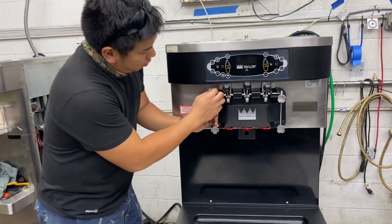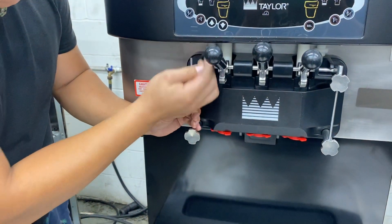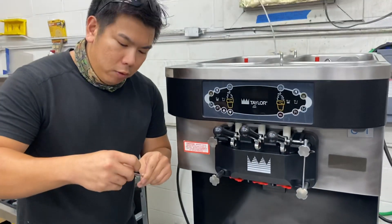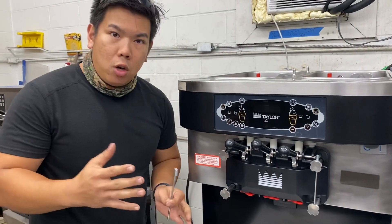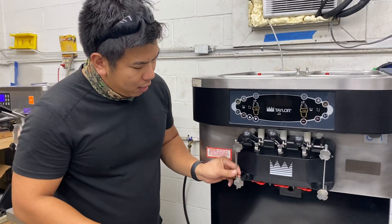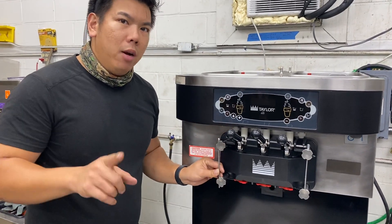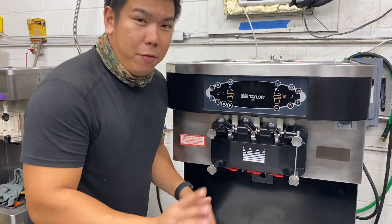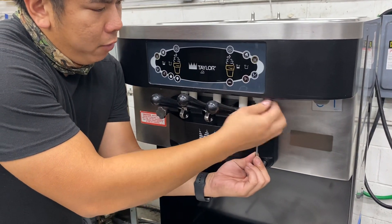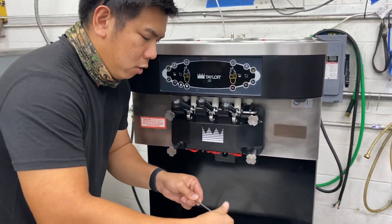With the pins, you have to unscrew the top to allow the locking part to come off, then drop the locking pin through. The reason we have these is because vibrations can cause the head bolts to come loose. What the pin does is lock it in place and prevent any movement, so when the system's under pressure nothing will burst out — it's not fun to come in with ice cream all over the floor and your machine. Slide through the bottom and make sure to put this back on so you don't lose it.